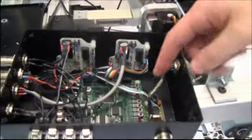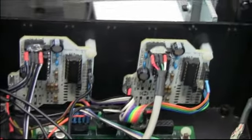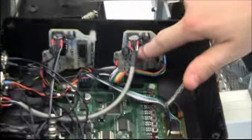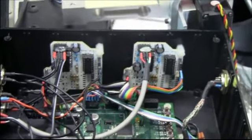So the motor controller block, all it does is take the weak signals sent out by the microcontroller and send them up to line levels to get sent out to the motors. The motor controllers control all the motors except for the servo, which does all this internally. One issue we came up with is that these chips right here, the driver chips, were getting really hot because they do a lot of the lifting. So what we did is we doubled them up and made them twice as thick. So there's 2 chips there instead of 1, which doubled our current output.